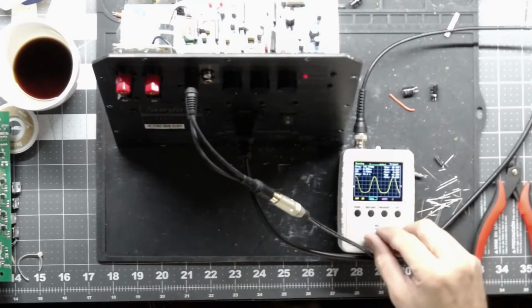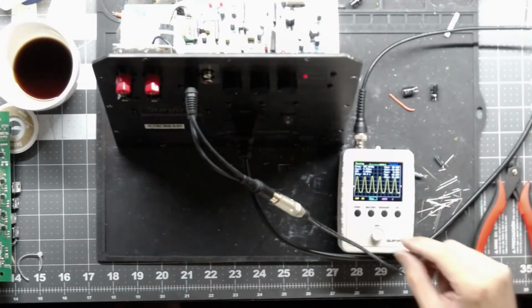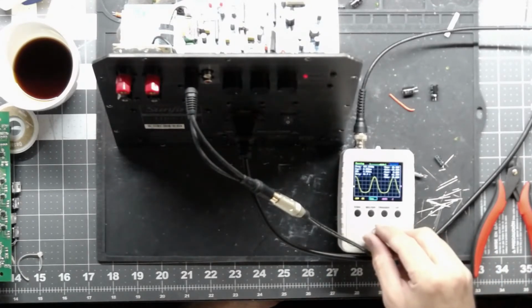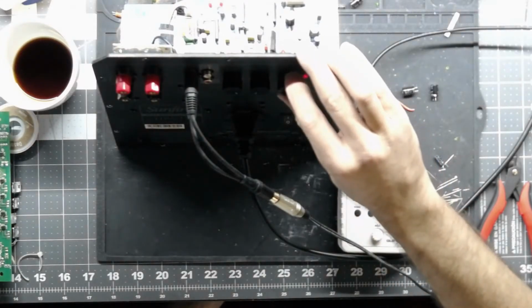It looks a little weird on the bottom, so I'll verify that on the scope, and I'll also check it with the speaker. I can't do that tonight though, because I'm going to have to turn the volume up on the speaker fairly loud to get a good measurement. But either way, it's putting out power. It sounded clean when I was running it through the sub. And I'm actually going to do it at a lower volume at 100 hertz just because I want to hear it.